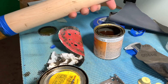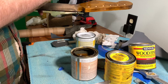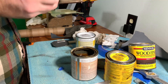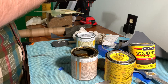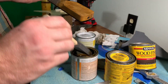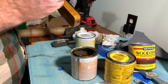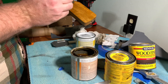The more you put on there the darker it gets. Now I have the bare wood and what I do here is just blend in the wood and the amber finish. I used the ebony stain on the bare wood side of it and just sand it back a little bit so you get that gray look to it, and I'm doing one more final coat of amber and blend it again so it looks a little bit more natural.